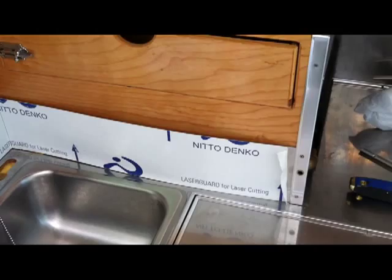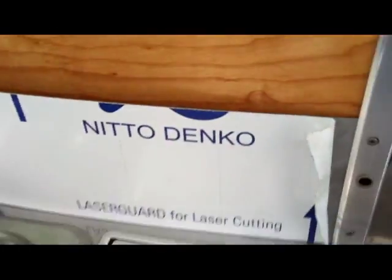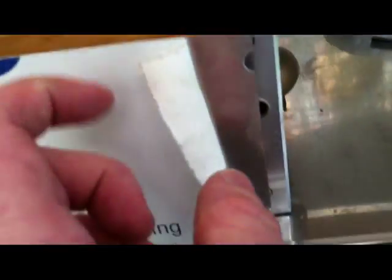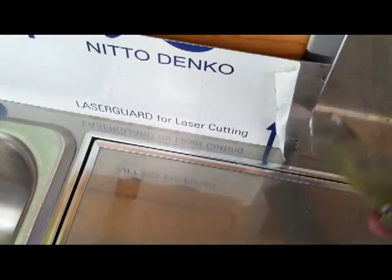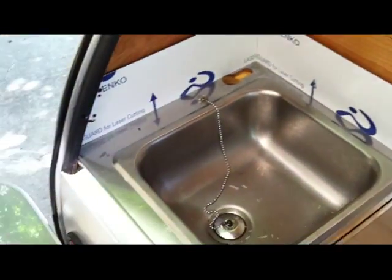As you can see it fits nicely now - nice and smooth, everything lines up absolutely beautifully, exactly like it should. They did a great job at the factory. All I did was take a rat tail file, which is a lot quicker than trimming down the entire piece - just to make it fit around those screws. Make sure to deburr everything really nicely so you don't produce any cracks. You can do that with a file or just rub your metal scraper right along the edge to clean it up nicely.